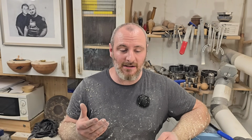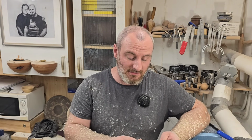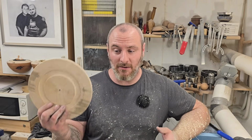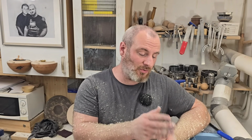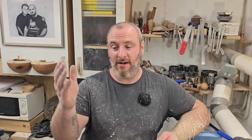In most cases, for most turners out there, using a grinder burr is more than enough, and I use it all the time. Again, I just like the performance of pulled burr, but as you probably seen throughout the video with pulled burr, sometimes it can have a little bit more grabby effect, and especially if you're just starting out using scrapers, I would highly suggest that you use a grinder burr, or you just use a hone, diamond hone. I haven't shown honing the edge, but it will basically do the same burr as the grinder.